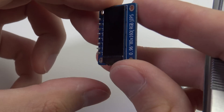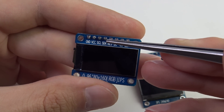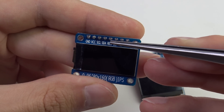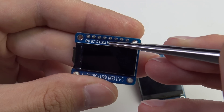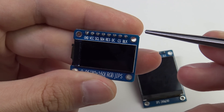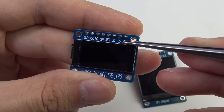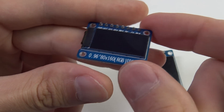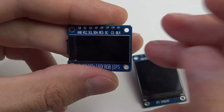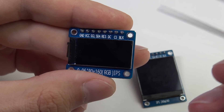The only way to communicate with them is via SPI. On the display connector there is a line for 3.3V supply, clock and data lines for SPI (SDA/MOSI for writing to the display controller), a reset line for the display controller, a DC line which tells the controller whether the current SPI transfer is data or a command, a chip select line, and BLK which controls the backlight. The board has a transistor that allows the logic-level BLK signal to switch the backlight, and you can use PWM on this line to adjust brightness.